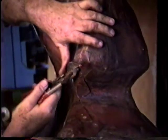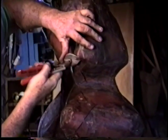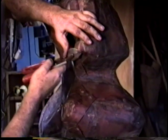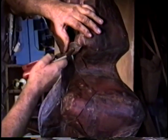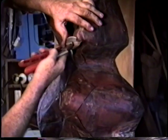Working on these things, you're just concerned with the little local spot that you're working on, so it looks like a good idea to kind of snug it down and weld it, and you're not aware of the fact that you're making an undercut that relates to an undercut on the other side, which makes it relatively impossible to get off without some kind of surgical process.